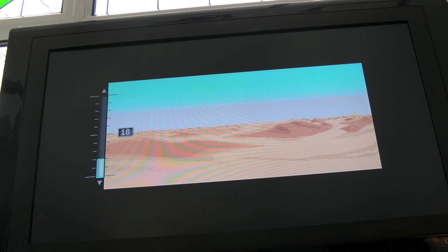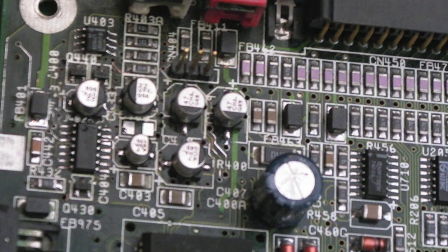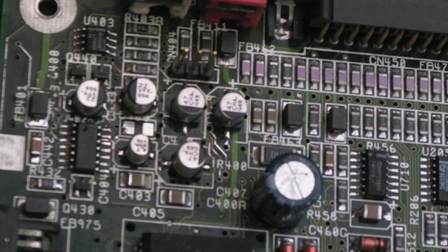So I'm going to go look up the size of that cap now and order one of those. Something I am aware of and had completely forgotten about: the audio coupling caps on this, the silk screen may be wrong. So we might need to swap, I don't know which ones it is, 22s I think, somewhere around here. I'm not too worried about that at the moment because we're just testing for very short periods of time. And bear in mind, they all shipped from the factory with them the wrong way around. So just for the few minutes I'm testing, trying to work out what's going on with the audio here, it's not a big deal. We can swap them around in a minute.